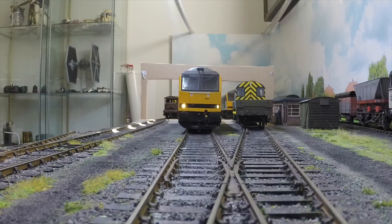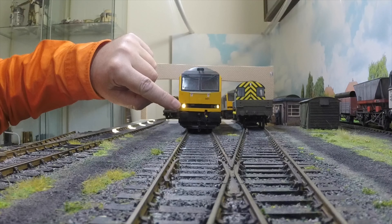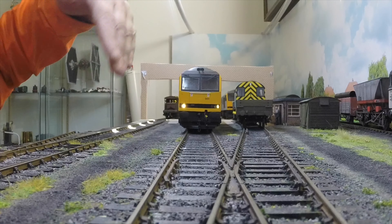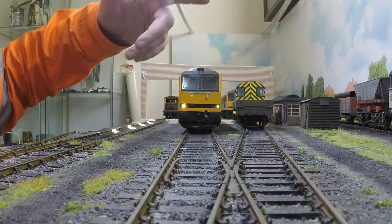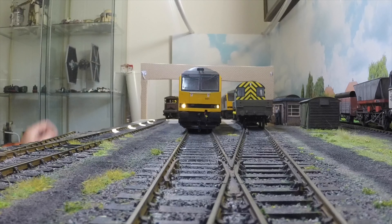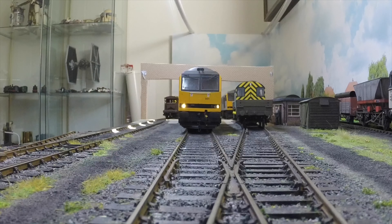And this is the daytime position for running with running lights. You have the headlight on this side, which makes it visible further on curves for people working on the track, and the near side marker light. It is less of an issue for trains coming the other way, even though the headlight is closer, because the ambient light makes it less glary and doesn't affect your night vision.